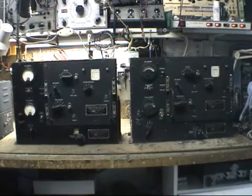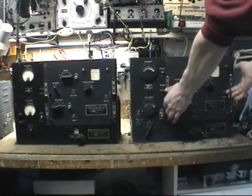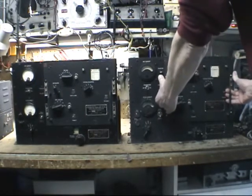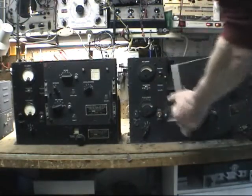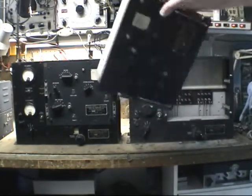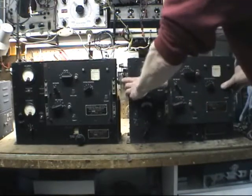They're about a 10 watt output, nominally 10 watts, CW tone, and it does modulate voice AM. What comes with it is a different set of tuning units. These tuning units unclip — I have the top lid off of that one because I was looking at the relay. The unit comes out. I believe there's three different tuning units and I'll show you them later. They slide back in depending on which frequency.